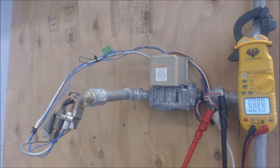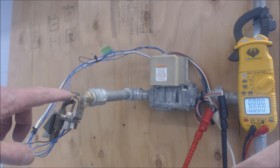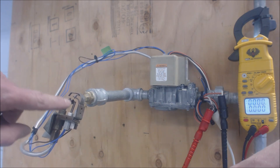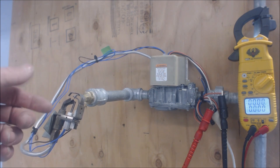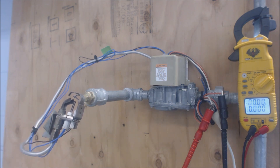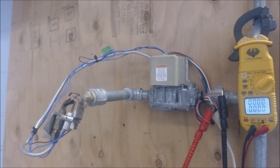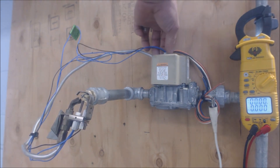The same rules apply with this and other pilot ignition systems — really any type of ignition system. You want to take some un-soaped steel wool and clean off the rod without hurting the hot surface igniter. That hot surface igniter is very fragile, make sure you do not break it. The silicon nitride replacements are solid rods and hold up a little bit better than the OEM. You also want to steel wool the flame rod and make sure the pilot tube is nice and clean in order to get your flame rectification signal. Remember, all flame rectification signals are carried back through a ground or a ground wire.